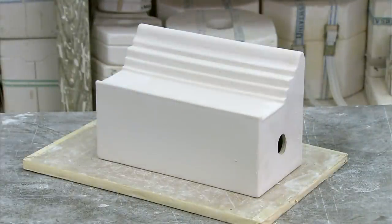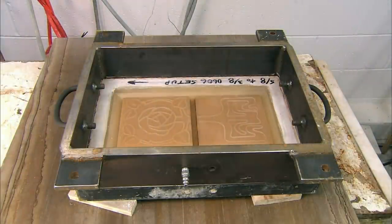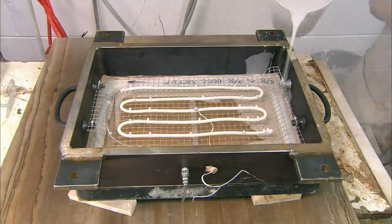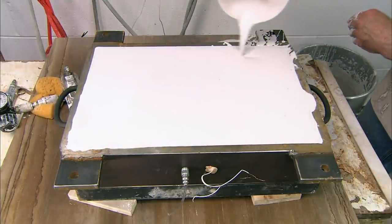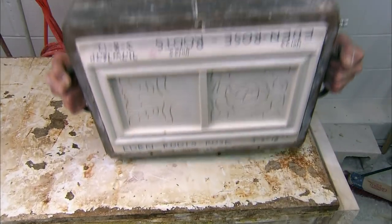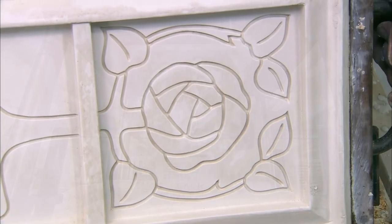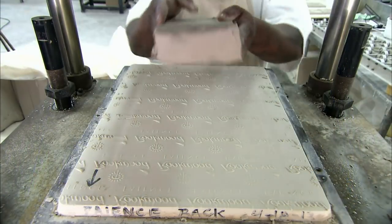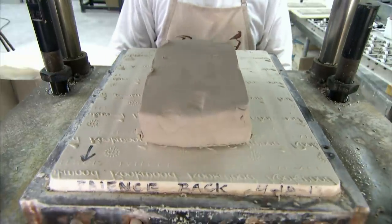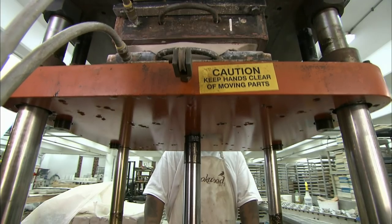Clay shrinks as it dries. To make the fireplace's ceramic tiles, they produce a rubber mold of two adjoining tiles, place it inside a metal casing along with a release system to help with extraction, and fill the casing with an exceptionally strong type of plaster. It sets in about half an hour, taking on the shape of the rubber mold. This plaster casting is the die they'll now use to produce the tiles. They mount the die on what's known as a ram press because it literally rams a block of clay into the die, compressing it with 30 tons of pressure. Like the dies and molds for the mantle, the tile die is also 11% larger than the final size.